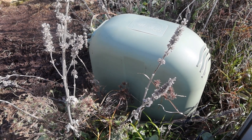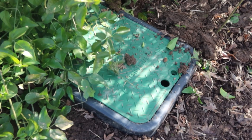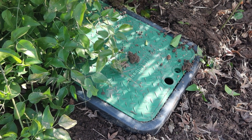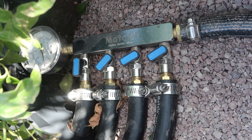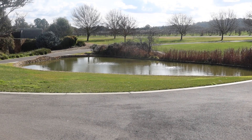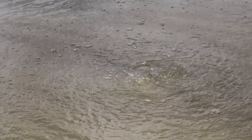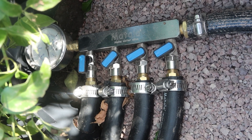This is what we call a remote system with the Hakko. The air pump sits up where the power supply is, then we run a single hose down to a valve box dug into the ground in a shallow trench. You're not trenching power so it doesn't have to be deep. Then we go out of that valve box into the self-weighted air hose which runs along the dam. In this case we've run it through pipework underneath a bridge, and everything is controlled — you balance the air going to each diffuser from the water's edge where you can see it.